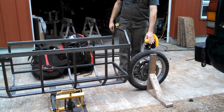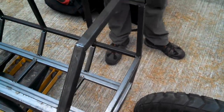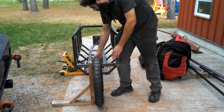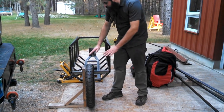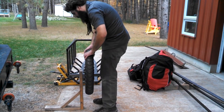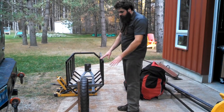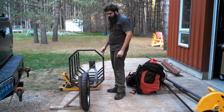This is not the wheel we'll be using — this is a front wheel off our spare parts bike. What we'll be using is a 17-inch wheel off the parts bike, but basically this is how it'll sit. We'll have a swing arm that comes out to here, and we'll have the shock from Brittany's old shock on her bike sitting either in the middle or on the side. This whole swing arm will be able to pivot up, and so the wheel as it suspends will go like this. The goal is that this has its own suspension — the front is suspended via the bike, and this is suspended via this suspension — so the whole trailer should be able to take fairly large bumps, washboard roads, and everything else.